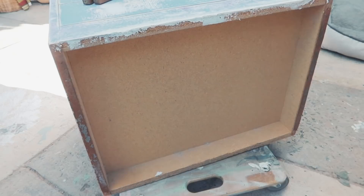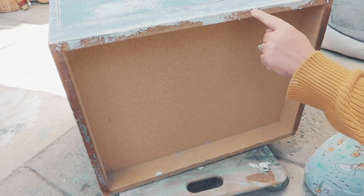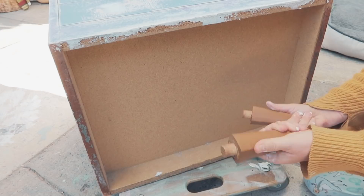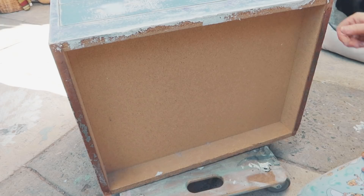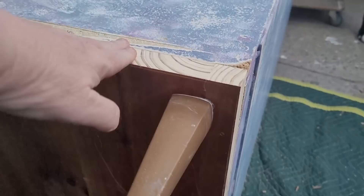Everything is now prepped and ready for me to paint. I still don't know what colour I'm doing, but I do know I want to put some feet on this. Now, this is absolute trash - screwing straight into it is not gonna be good. It's just particle board, it's not gonna be great. These are the legs I've got; I took these off a cute little smashed-up replica MCM piece. I want these on here, so I need to figure out how I'm gonna make that happen. What I think I'll do is get one solid piece of wood - I've got plenty because I stash everything - just to fill this bottom, so one solid piece that will take all the weight and I can screw into that.